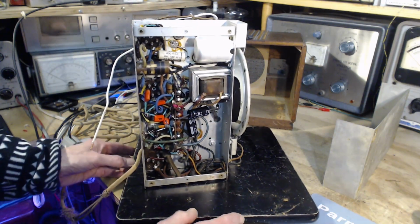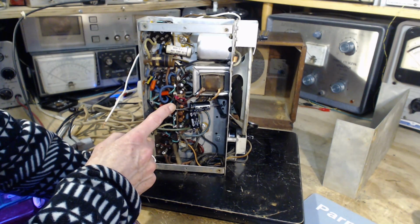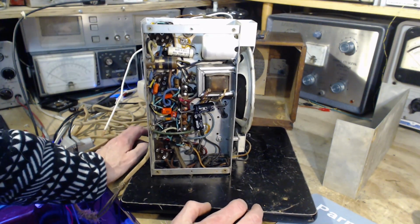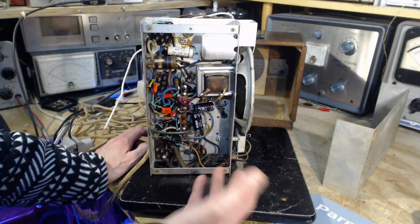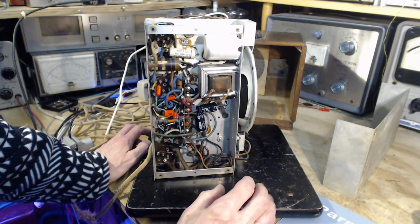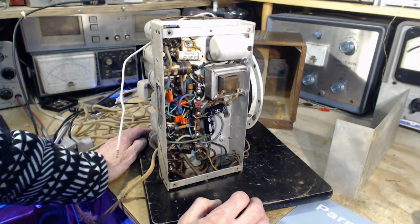So I think the question would be, did the last guy accidentally do something here that is not quite right? Because the radio's humming, and it really shouldn't be humming, my experience with these guys with field coils is that even if the filter capacitors get very weak, and they usually start out quite small, 10, something like that, you still get almost no hum. The coil is very, very effective. That's my experience. Whether it's valid or not, I don't know. It's just my anecdotal truths.